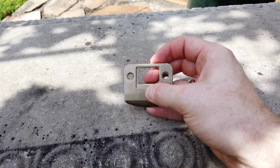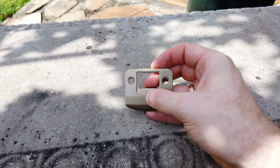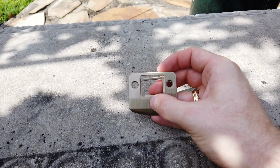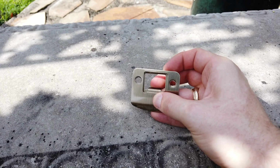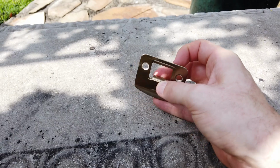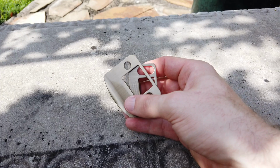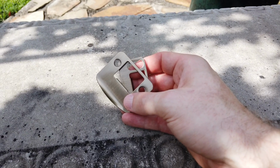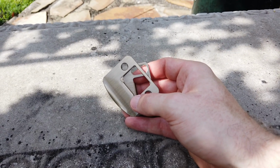But for whatever reason, if the door moves around a lot, your foundation moves. We are in North Texas. Foundation movement is very common here. You can loosen those screws a little bit and adjust this keeper plate. So again, it's kind of future-proof. It's a pretty basic, simple concept and design, but not a lot of other vendors are doing it, and it's yet another reason why we really like ProVia and the quality that they provide.